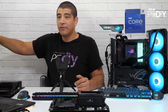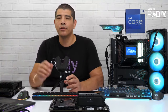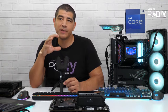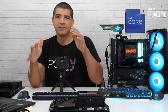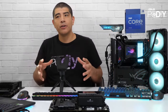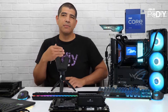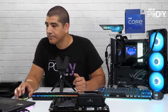And that means that if you had an analog audio design, you actually get no benefit. So it's a balancing act of looking at the users that might still use analog-based headphones, where they're going to be positioned, and where they have value. So it's kind of a tricky situation. And also, of course, if you bring it down in the board stack, you would be increasing the cost. So we do try to balance things out in terms of offering a very good quality audio solution, but at the same time making sure that it's sensibly in alignment with what the users are adopting in that price band. Okay.